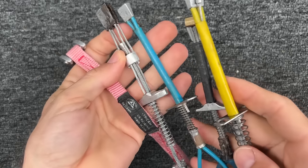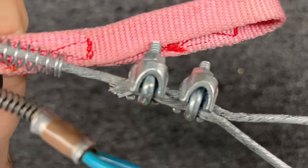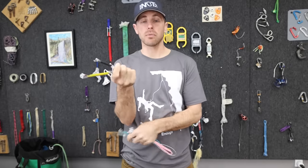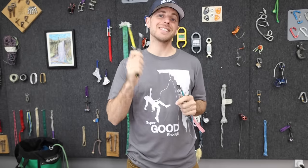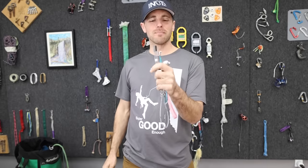These have been on the to-do list for 6 months to 2 years. But with our last cam crusher, it was just too big and too flexible and too weird to do the small stuff. This actually will go up to a number 4 if you overcam it, a number 3 perfectly well. And even with this cam crusher 3.0, we could put some pressure plates on the inside to see if we actually get 4 times the pressure going out as we apply in the pull — which is what the math says. But nothing, as we've learned, is perfectly the way math says it should be.